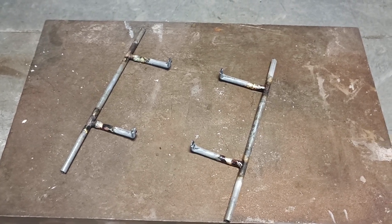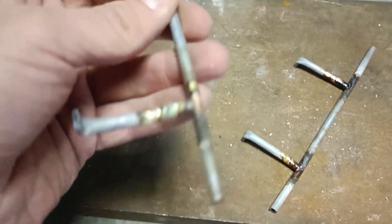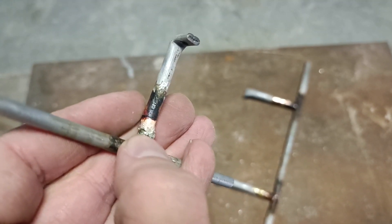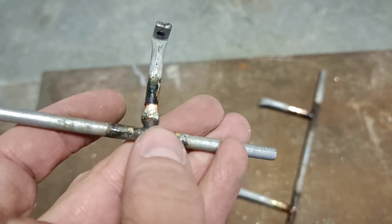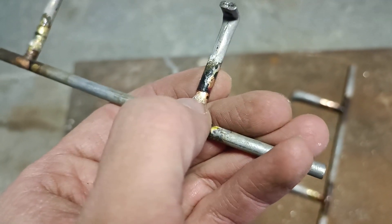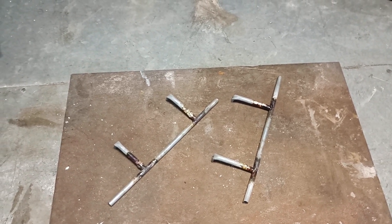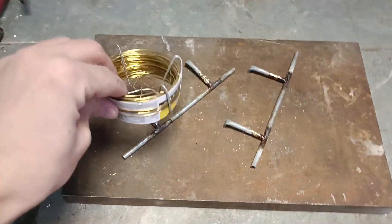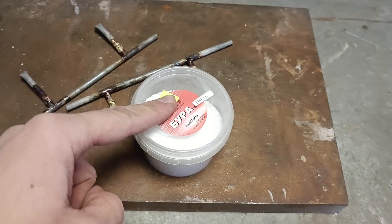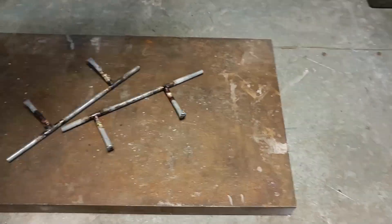I will hold them there for a couple of hours. After brazing — I believe you can see it — here we have something like glass. When you braze you use what's called solder. I use welding wire and I use this flux — I'll drop the English name for it. When it gets inside the flame it becomes like glass.